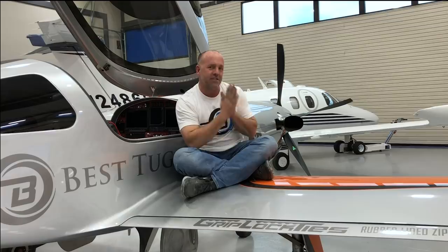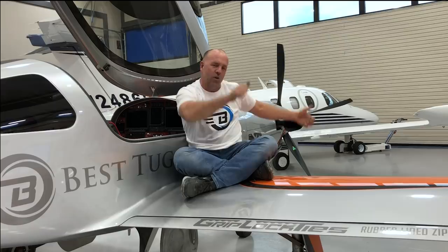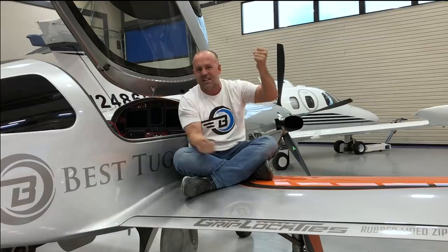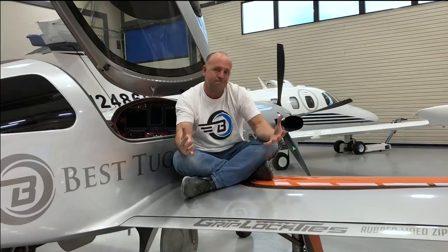What I'm going to do is build a way to take the impact of a ground loop, absorb it with suspension out of a carbon fiber and fiberglass combo — basically a leaf spring on a wingtip. I want to transfer the energy of the impact from out at the back of the wing where it wants to twist the wing, and transfer it into the center of the wing so the load is where the wing is designed to take it, up towards the front of the spar. And give it 14 to 16 inches of travel to absorb about 600 to 800 pounds of impact before you even touch the wing.